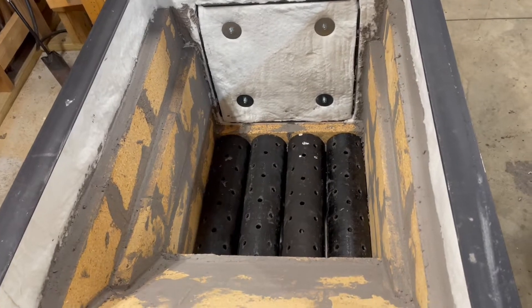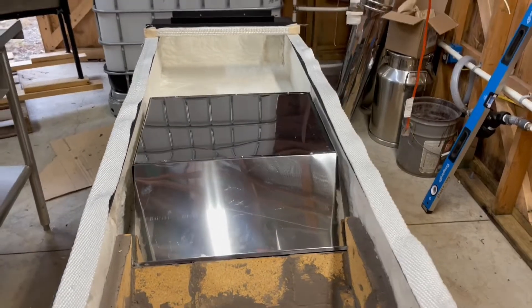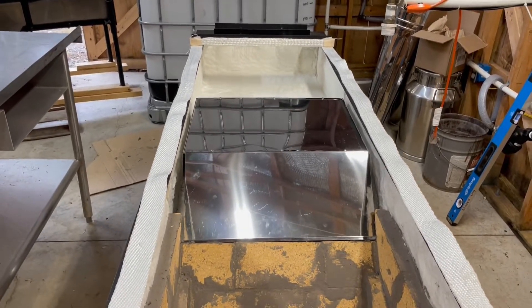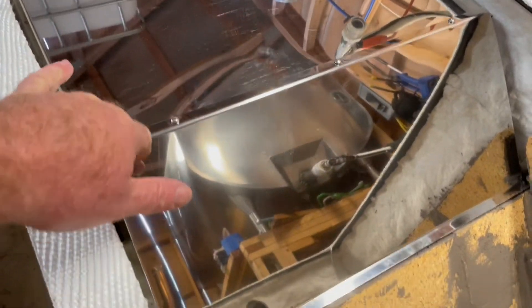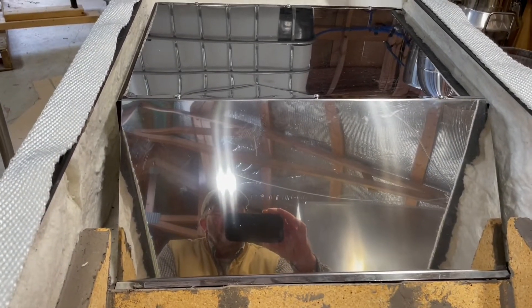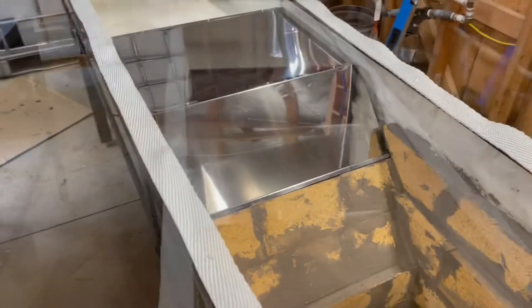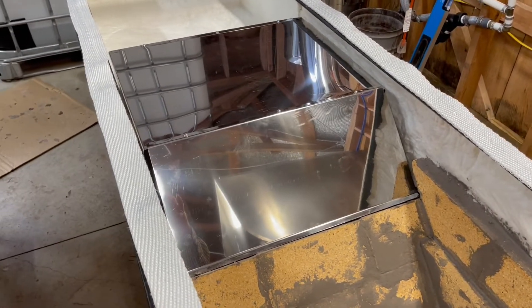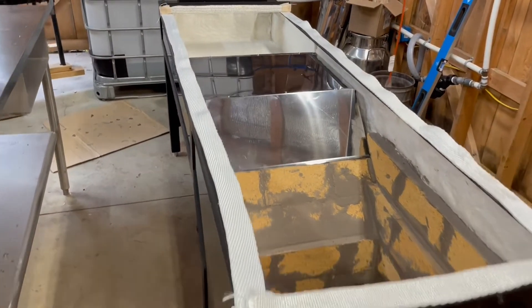Here we have the rail gasket on - that's the insulation that goes on top of the arch. It makes a seal between your pans and the arch so cold air doesn't get sucked up into your pans decreasing the boil. The other thing we put on here is the belly pan - this is a diversion hood scoop that diverts the hot air up into the pan that sits on top, so hot air comes up, goes over, and then up into the pan and is pulled up through into the drip pan. It did not come with the arch - I think that was a mistake somewhere - but Smokey Lake did a great job getting it to me as soon as I notified them. I really appreciated that.